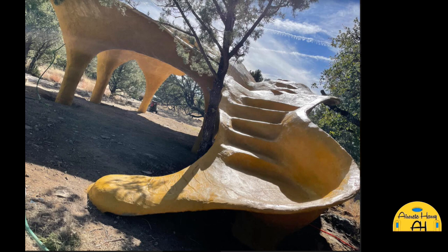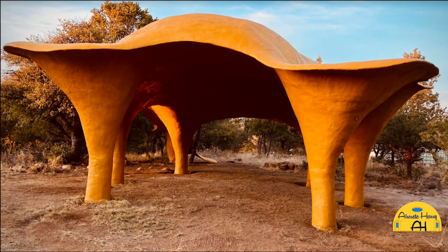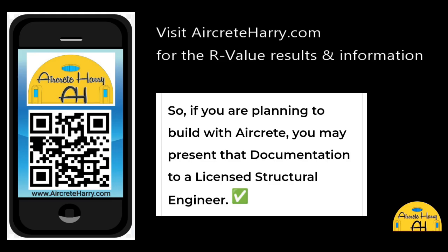I'd probably pump that into the walls to create that insulation and get that nice balance of thermal mass and insulation like those pumice-crete people do. If they're 3-bag mixes, that's amazing. I think we kind of have to stick in that 4 to 5 bag per yard range to get something structural, but it's worth it. It's nice stuff.